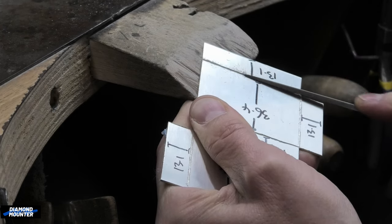I've got these all filed out now. Going around the outside getting all these edges right. Once you've scored these lines, be careful not to start flexing it about — keep everything flat and straight. File these fairly sharp without going too far. So this is ready to go. You're better off filing too much of an angle so there's no metal getting in the way stopping you folding things up. Make sure it's nice and flat, not rounded.